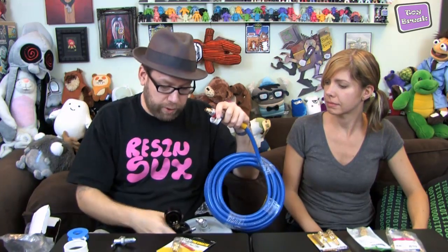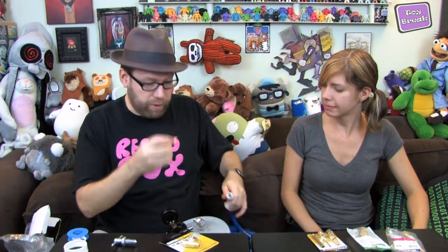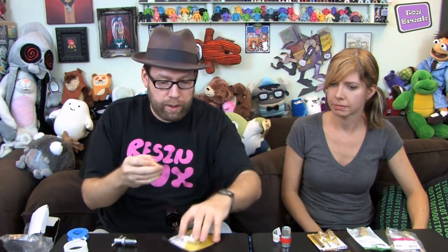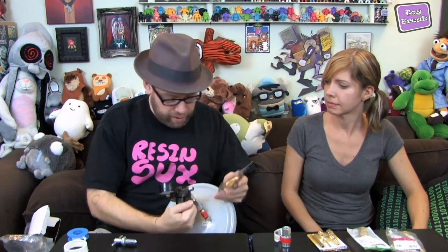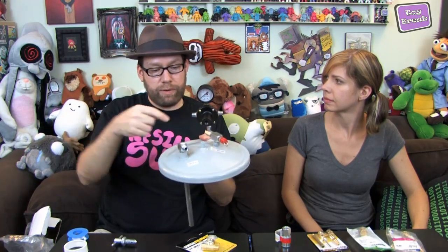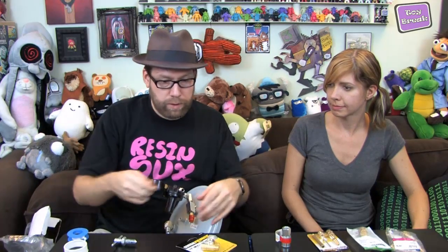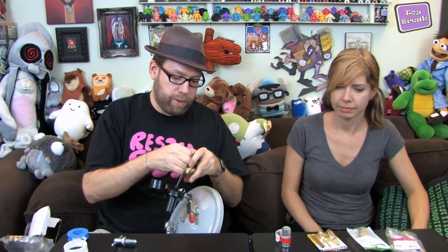This quick release goes on your tank so you can easily pop it on and off. But you're going to want to control the air going in, so you'll want a shut-off valve — an on/off valve basically — between the tank fitting and the air intake. These tanks are made for paint, so there are all sorts of ins and outs. You need to cap the extra exit holes so air can only go in one way and stay trapped — turning this into a pressure tank.